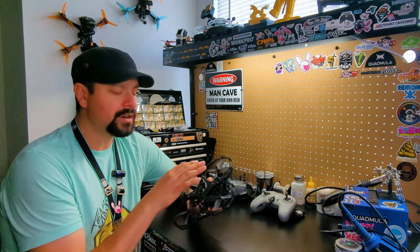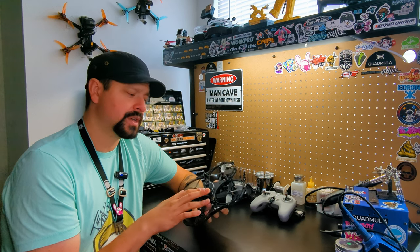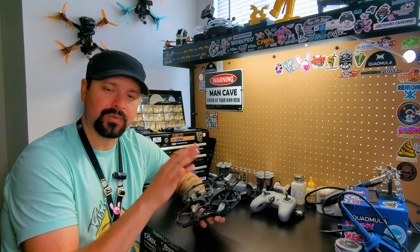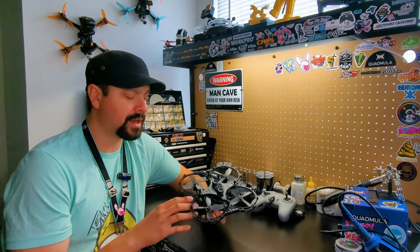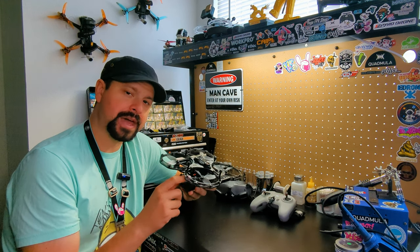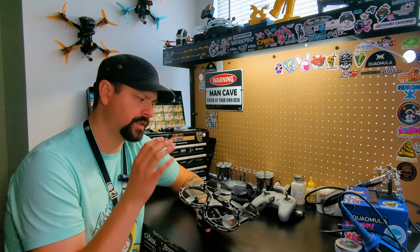Just like in my previous installation video for the motor upgrade, soldering the motors to the ESC is really quite straightforward. You're just gonna orient them the same way the stock motors were, and you're gonna go ahead and solder the wires in the same order to the ESC. There is some further soldering though, because the battery lead itself is a little bit further back, so you're gonna have to extend out the battery lead, and of course you're given all these materials with the kit.